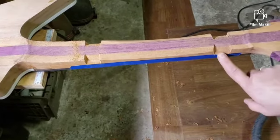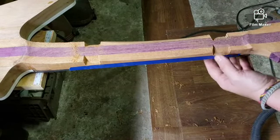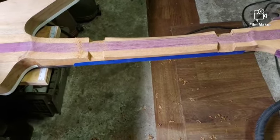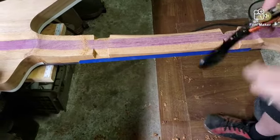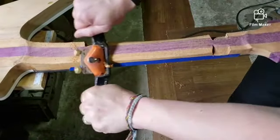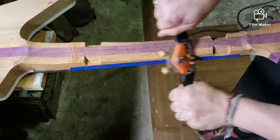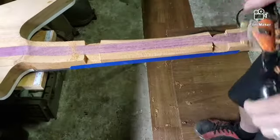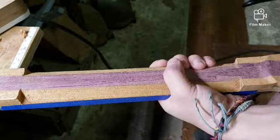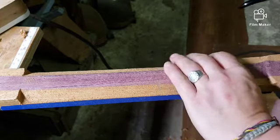Now that we have this line, two-thirds of it knocked off, and to the 5 mil there and 10 mil there, you're gonna take your draw knife or file or whatever, and then just bring this down. Okay, now that we have essentially a triangle, kind of, which a lot of people who lust after the old 60s Strats, a lot of them kind of had a neck like that.